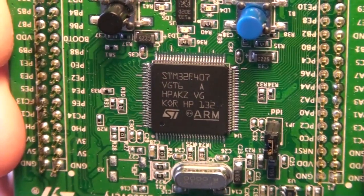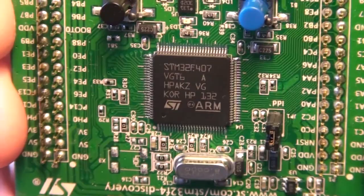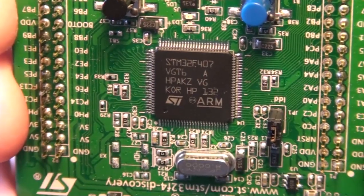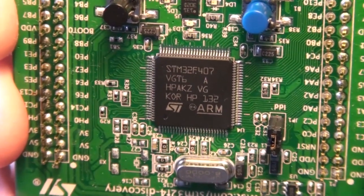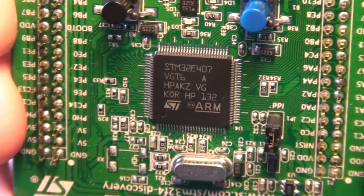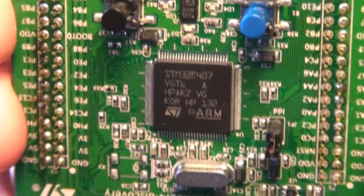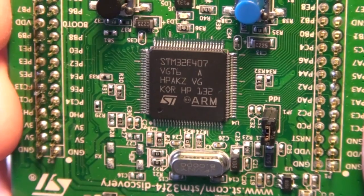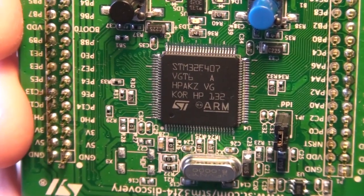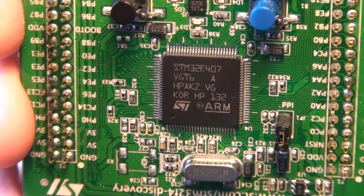Well, this new chip is, instead of being a Cortex-M3 as the other series, a Cortex-M4. Of course this is an ARM, the Cortex series of ARM processors, but this new M4 speeds up the processor and adds some other internal assembler commands to the command set, the Thumb instruction set. This new Cortex-M4 also includes a floating point unit. This is a great device to add to this processor, because a floating point unit enables you to do floating point math a lot faster.